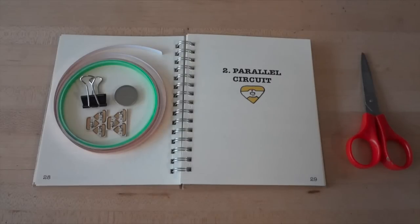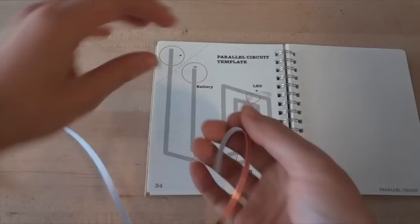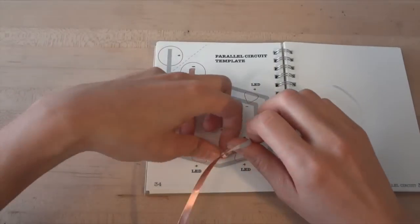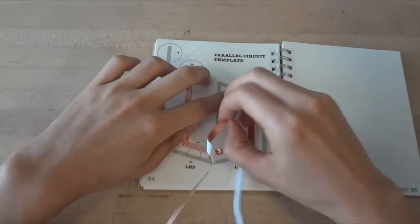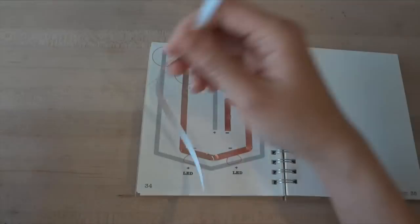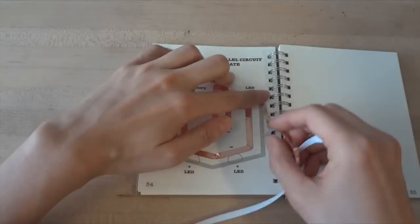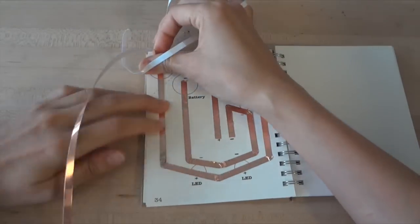In this tutorial, you'll need three LED stickers, one coin cell battery, one binder clip, some copper foil tape, and scissors to cut your tape. First, stick conductive foil tape over the gray lines on your template. This will create a track that leads from the battery to the LED — use one continuous piece of foil for each side of the track, and fold at the turns. The inner foil connects to the negative of your battery, and the outer foil connects to the positive side of your battery, and you can put your LEDs anywhere along this foil track to turn them on.